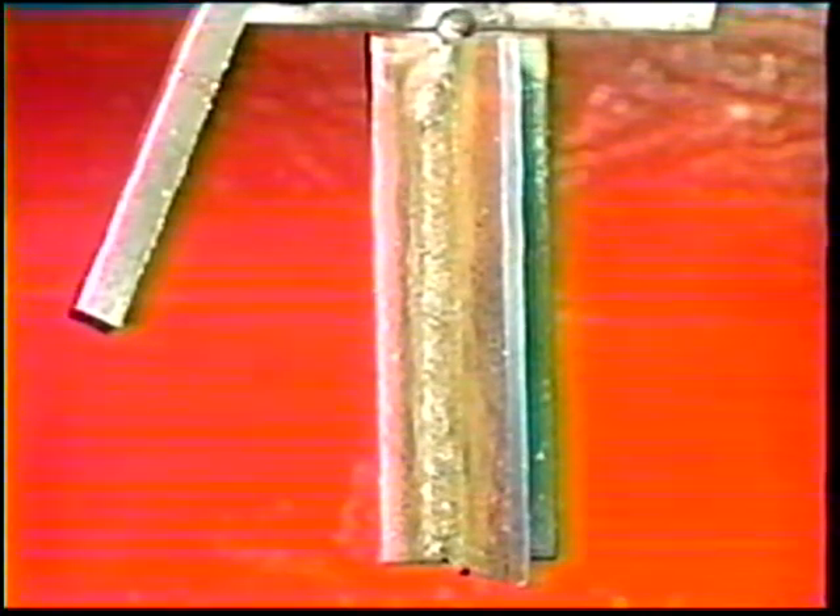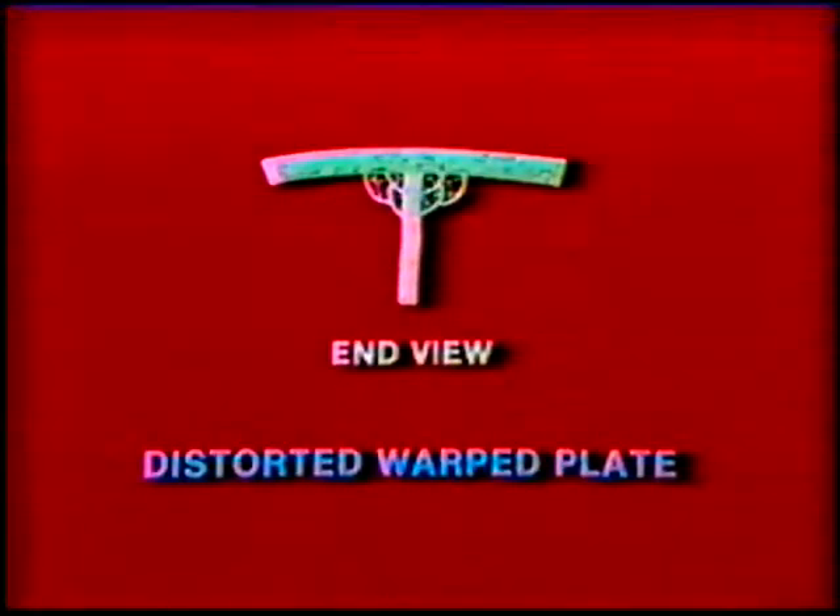The objective of this job practice is to make a sound multi-pass fillet weld on a T-joint in a vertical position using uphill travel. This method is widely used to help control distortion where a large fillet is necessary. Large single pass fillets are not recommended for uphill travel.